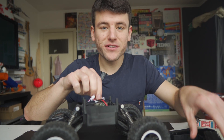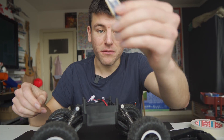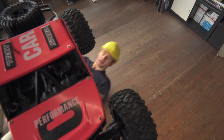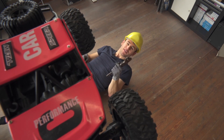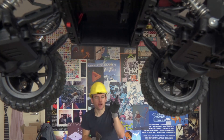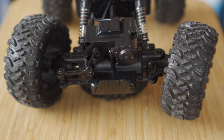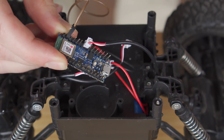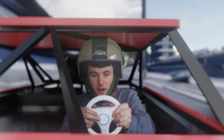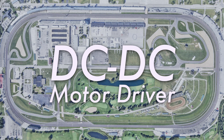After a good night of sleep, I've decided to throw this all away and use a little microcontroller instead. First I need to figure out how to control the motors. If we dig a little deeper, we see that the car has three motors — two for going backwards and forwards, and one for turning left and right. If we simply power DC motors, they will always turn in the same direction. If I connect them directly to my Arduino, the car will only go forwards and left. So unless you're building a NASCAR car, I'm going to need a separate DC to DC motor driver.